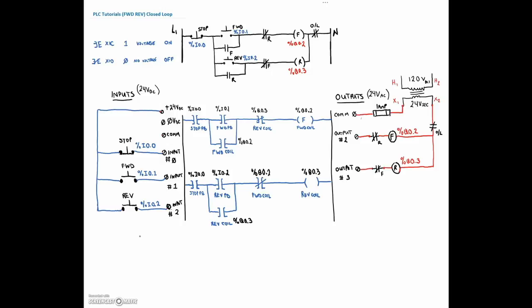The first thing we need is a holding contact on the forward coil, so I'm going to make use of the normally open contact on my forward coil. Then I'm going to make use of the normally open contact on my reverse, and then because I've used the normally closed contact on the overload, I'm going to use the normally open contact on the overload as well. Each of those is going to go into my inputs. For my forward coil, the holding contact is input number 5. My reverse is input number 6, and my overload is input number 7.